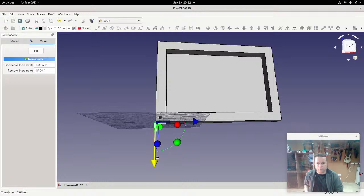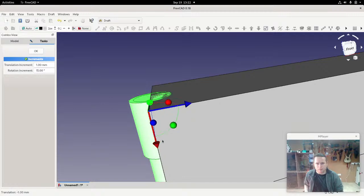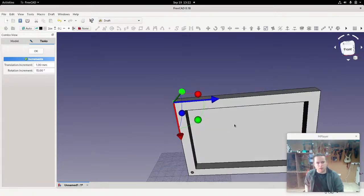Okay, so it's the right direction. We'll move that up to the top. Yeah, just there. Now, where does that go? Well, when I made these, I was thinking about having them evenly around the shape of it, so it was almost the same distance in all places. So if I want 2 along here, what we're going to do is take this space and divide it by 3. Because if you think about it, 1 space, 2 space, 3. These 2 spacers is where the LEDs are going to go. So you take how many LEDs you've got, add 1 and divide that in, and that gives you the distance from this point here that you wanted.